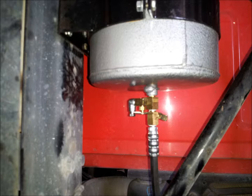Using the thread sealant provided, install the non-swivel end of the 1/4-inch pressure hose assembly to the bottom valve on the oil refiner canister. There are two valves attached to the bottom of the oil refiner canister. The one on the side with a 90 degree elbow and plug is for taking oil samples. The bottom valve is for regulating the flow rate of the incoming oil.